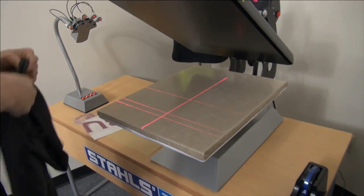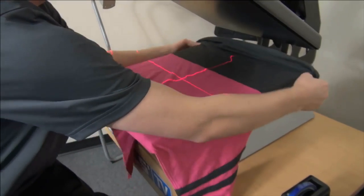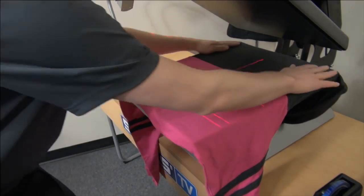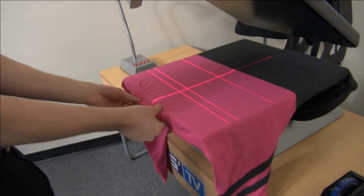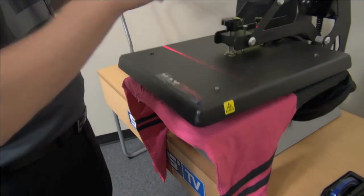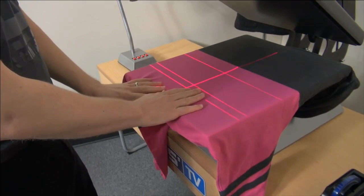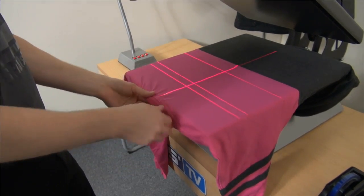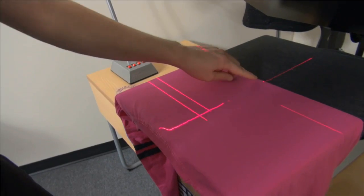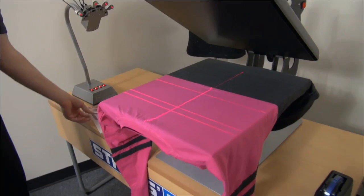Loading this onto the clamshell to show you another style of press. You want to make sure your shirt is relatively flat. If you have some wrinkles and creases because of the packing, you can see how it throws the laser off — you want to preheat first to remove those wrinkles so you can get a flatter placement. Anytime the laser is traveling over a seam or an unflat area it's going to throw the laser a little bit, so be careful — it's not as useful for going over seams.